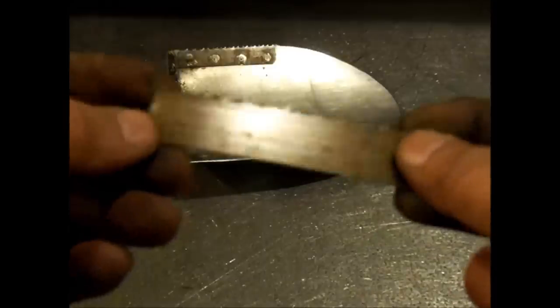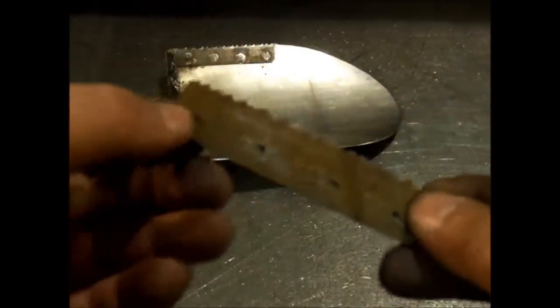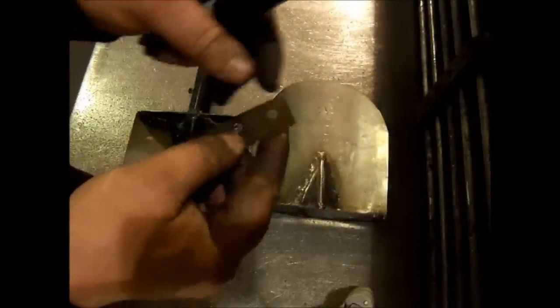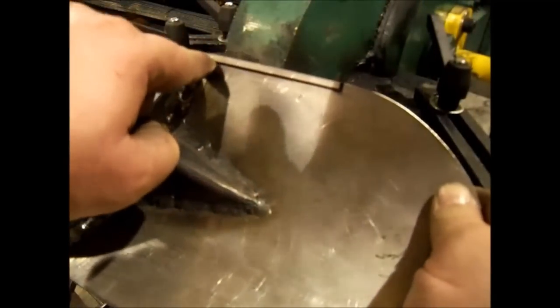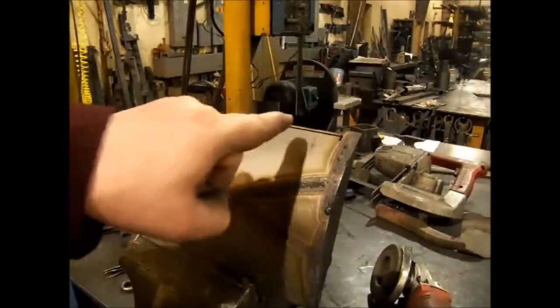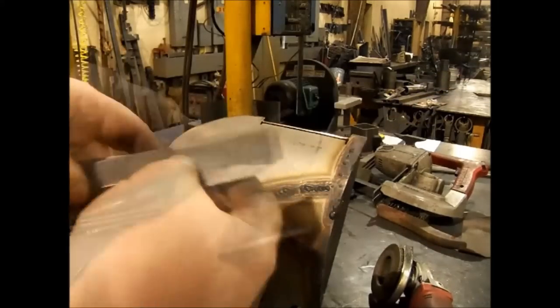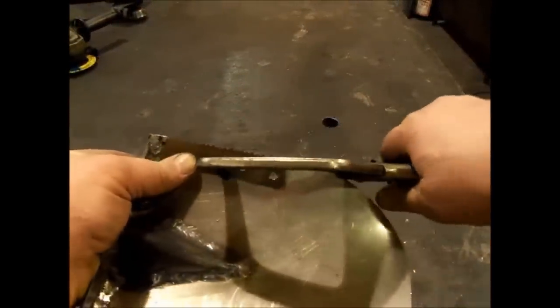The next thing I want to do is install a blade. I take the saw blade cut earlier into a 3¾-inch length piece. I pre-marked it and punch it — now it's ready to drill quarter-inch holes. We have the holes punched. This is where we're going to tack-weld it to the shovel head. I'm planning to take a notch out of this shovel blade — put a mark on the back side so I can get a bevel in there. I'm going to grind back just so it sits at about a 40-degree angle. Take some sandpaper and make a file. Then we'll put the saw blade on and tack it in place. There's about a quarter-inch worth of blade — we want it flush with the side of the shovel. We'll clamp it. Your blade is now installed.